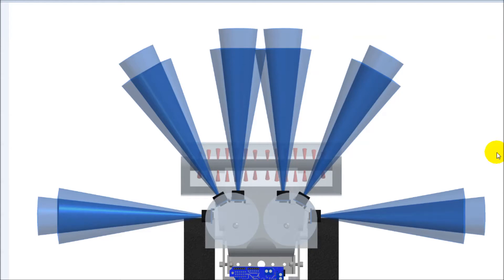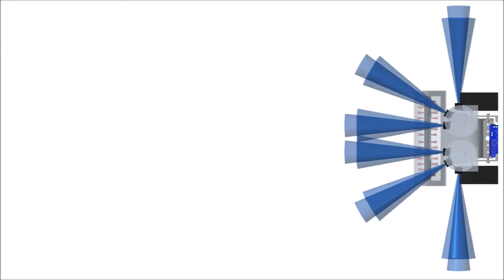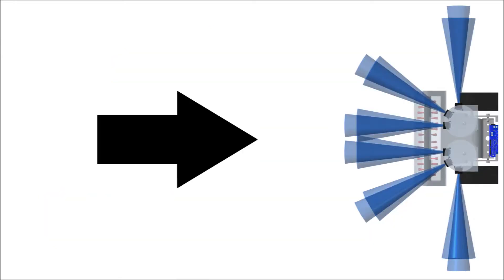This is the picture of a robot seen from above. It has 6 ultrasonic sensors HC-SR04. These blue fields show the theoretical angular range of sensors — about 12 to 14 degrees range. In this movie we will concentrate on sensor number 3 which looks forward.